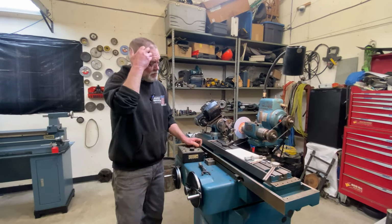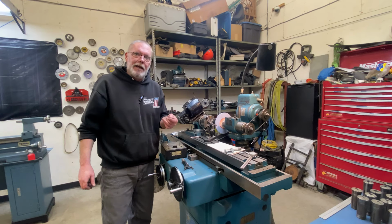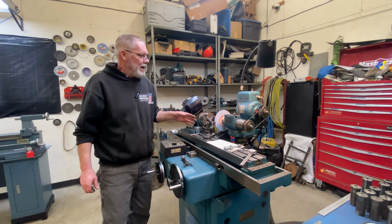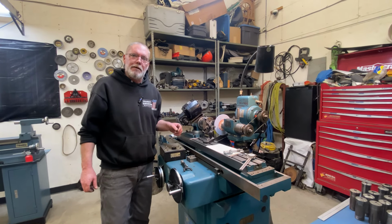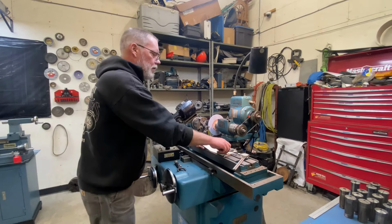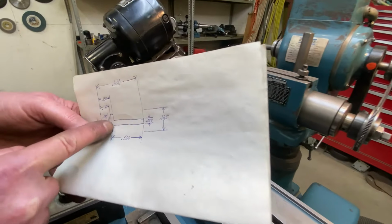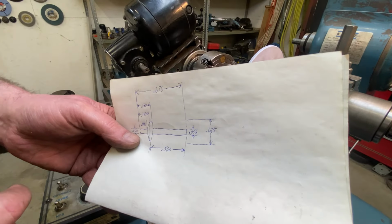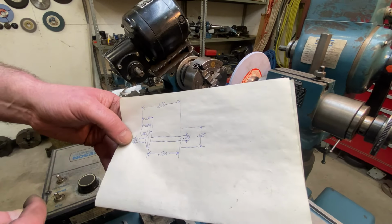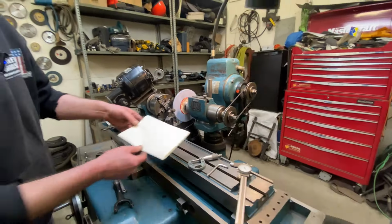My original plan was to bring the length I need down to the 1/8 diameter. That way, as I mentioned before, I can get it in a regular collet. But this thing is grinding so darn well. It seems so stable. I was worried about chatter and everything else, but it's just working so darn well. I'm going to see if I can't get lucky and pull this part of the pin off all in this same setup. This will be leaving quite a bit more sticking out than need be, but if this keeps working this well, it shouldn't be a problem.